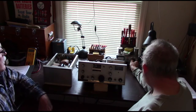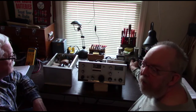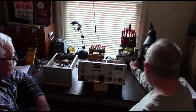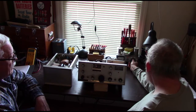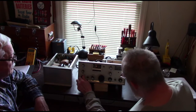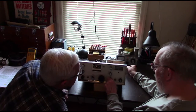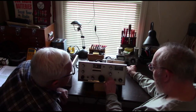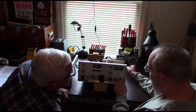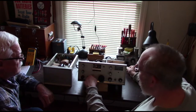All right, let me move this on up. I believe we're going to hear something — 117 volts, which is what I usually keep it on for these old rigs. My house voltage runs about 126, which is usually too high for these things, so I try to keep it around 117 to 120. You can hear it — here it comes. That's a good sound. All right, now let's see if we can peak it up — you watch the meter. That was it, back it up — right there, that's good. Let's check the exciter — it's going down, back up. Okay, right about there, now we've got the peak. Let's turn it down a little bit and put it on AM to see if we can receive something.